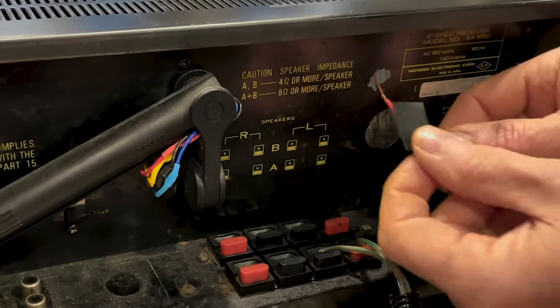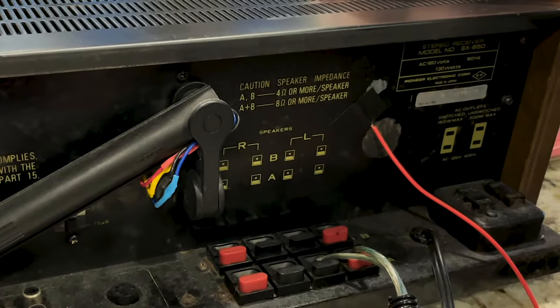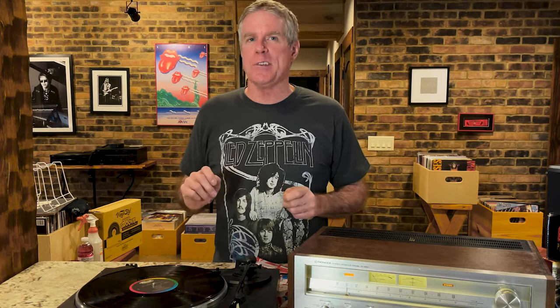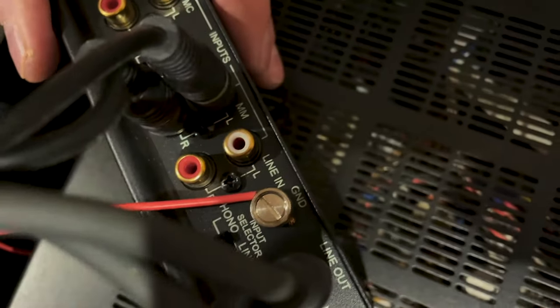In the rare case where there's no ground connection on your amp or receiver, you can MacGyver it by taping the end of the ground wire onto a metal part of the chassis — gaffers tape works especially well for that. If your system already has a ground wire connected and you're still having grounding issues, unscrew everything and get rid of any oxidation on that ground wire and the fittings. Use some sandpaper or steel wool — you want bright, shiny metal — then screw everything down tight. That can actually fix the problem a lot of the time.